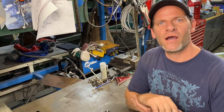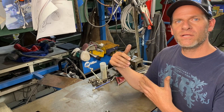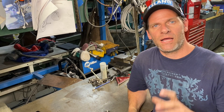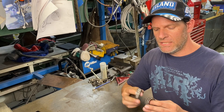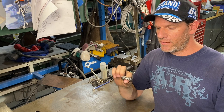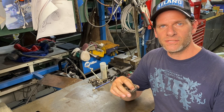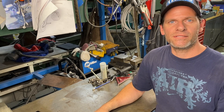Earlier on in the week we got the back section of the minibike all together. Now we're going to be working on the front — something that's going to hold the front forks — and it's going to tie the rear with the front. To do that we need to make a headstock first, and I'm going to be using some bearings basically used for trailer axles. They're a tapered bearing and I'm going to make a housing that holds both top and bottom bearings inside. We'll turn that on the lathe, then install it and work on tying the two together.